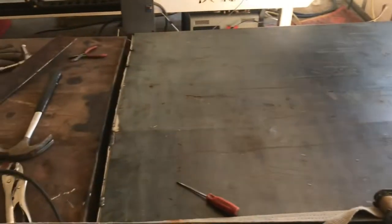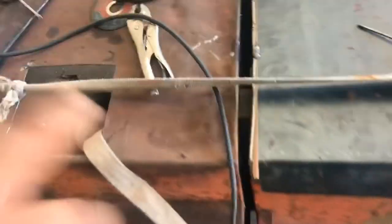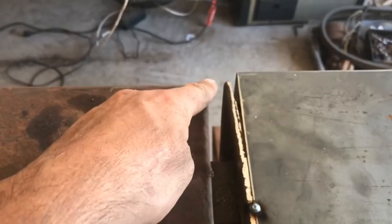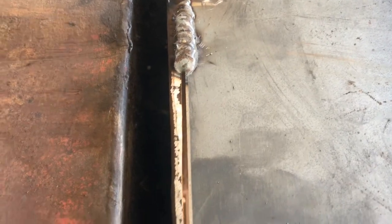Got her tacked in there. I had to put a clamp on this side and just suck it in tight right up through here. We just gotta start welding it in right now. When we get out of these ends they flare out just a little bit and I think I'm going to try to just pull them in, see how that works. The welds are working — just able to push that weld in and fill that gap.